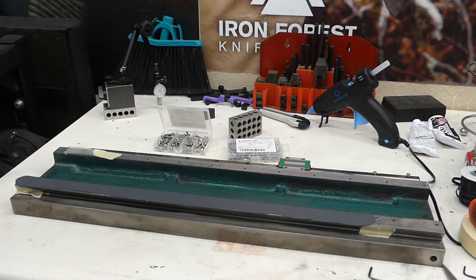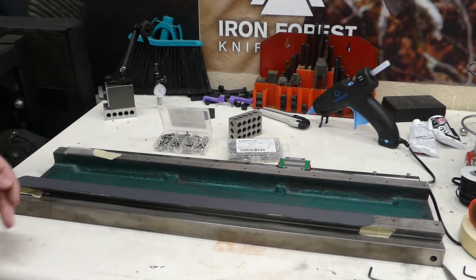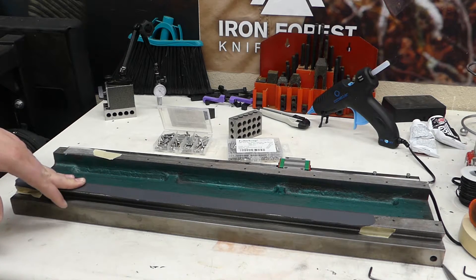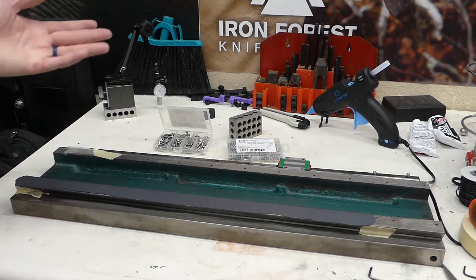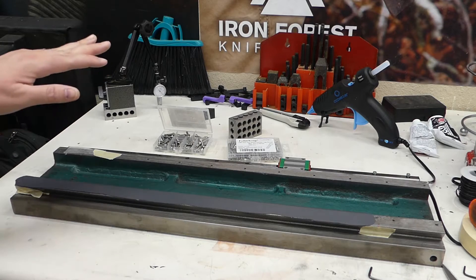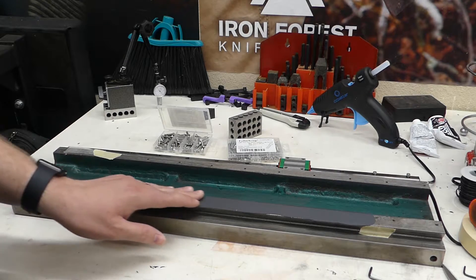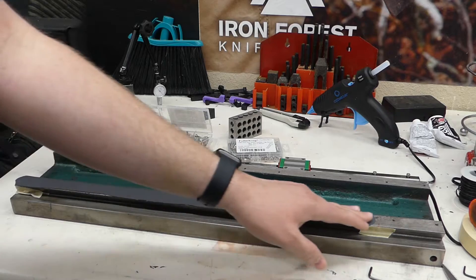Left and right it's flat, and also over the whole length because it just casts the surface of my straight edge across the whole thing, which is pretty awesome. On the next one I still have to cast the end of it again because the straight edge isn't long enough. For the next one I'm not going to use wax paper — I'm going to use this thin plastic from the laminating machine backing at my sign shop. It's very smooth and probably a consistent thickness, so it should come out almost perfectly glossy. There are a couple little spots where it's slightly low, but it's nothing to be concerned about.